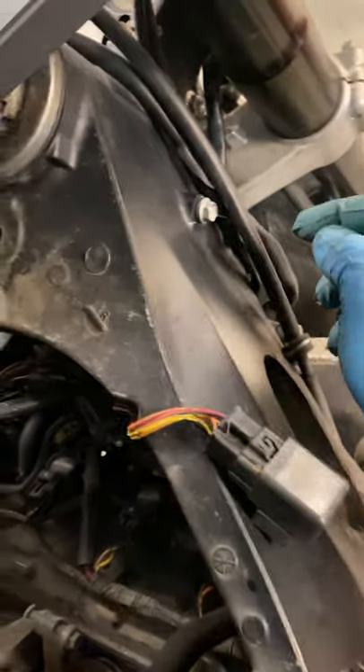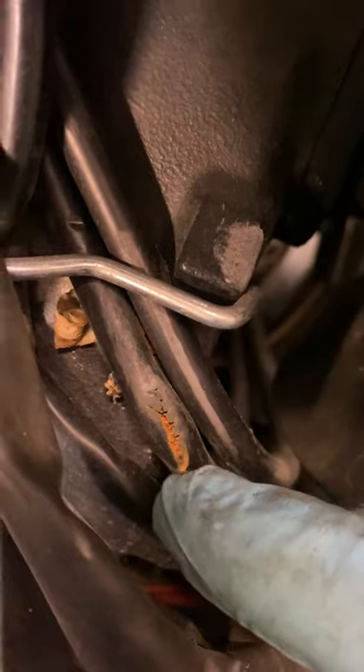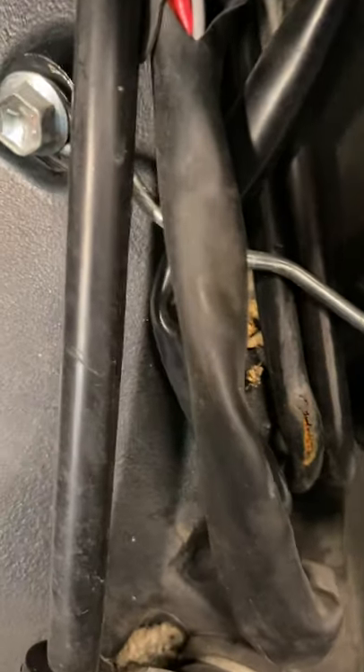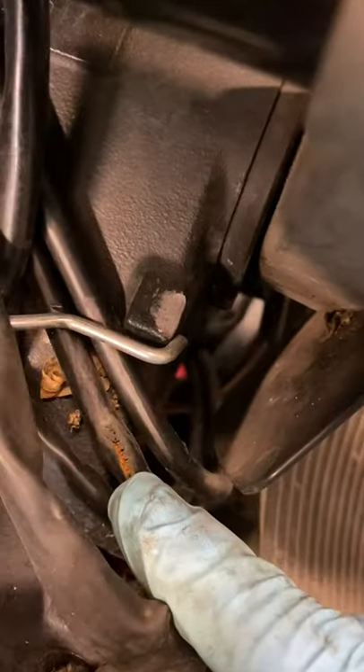Here's another hang-up point — and this is a perfect example right here. Even though the throttle is coming back nice, we're going to replace this cable as preventive maintenance. Check that out — see the fraying? That back-and-forth movement wears it out, and I've seen cables get pinched between the steering stop and the handlebar, which just destroys them. So we're changing this one.